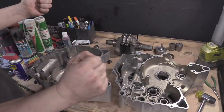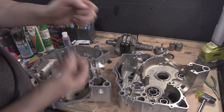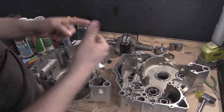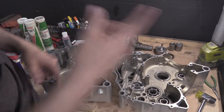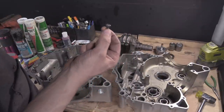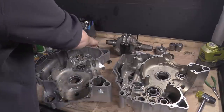And then you give it the full fucking beans, and then a shaft slides, gears lock up, because your input shaft can now move, right? Or your output shaft moves in a bit. Something else clashes with something, and then all of a sudden it's catastrophic. And what was it over? It was over sticking the wrong fastener in the wrong fucking hole. It is severely important.